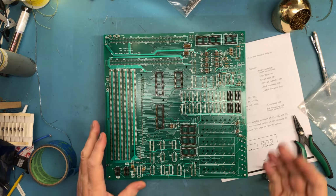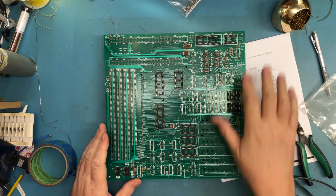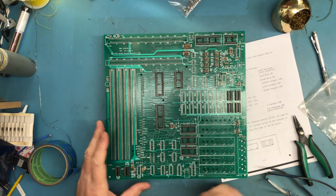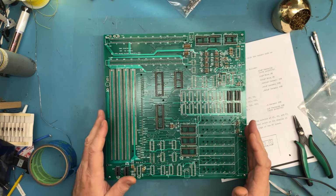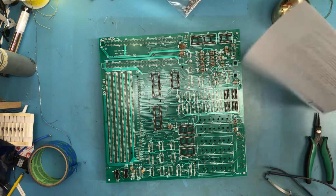So I typically insert components on the board from the lowest profile to the highest profile. We've got all the resistors in. I've actually added a couple of diodes here off camera. The capacitors and everything else I think are going to stand higher than the socket. So I'm going to move on to the sockets next, which is what we have some of loaded up here.